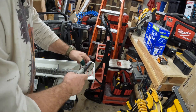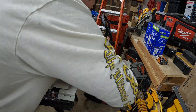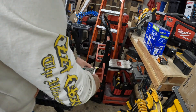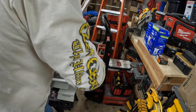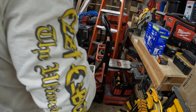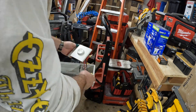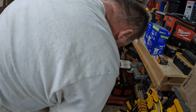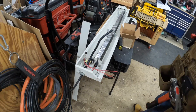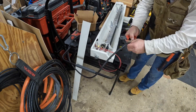I'm attaching this cord and stripping back the conductors to make my connections. I'm also pushing through two pieces of number 12 THHN so I can locate my thermostat on the other side of the heater — power coming in on one side and the thermostat on the other side, just for convenience. You need to extend the conductors in order to do that.